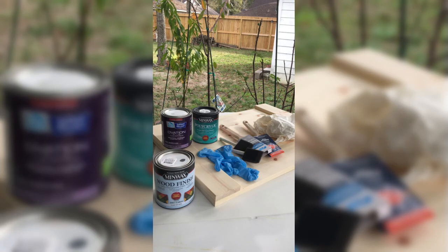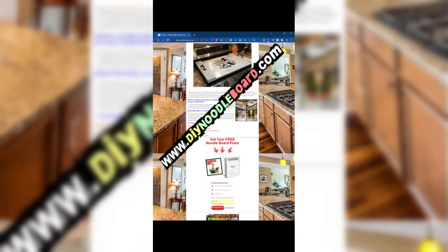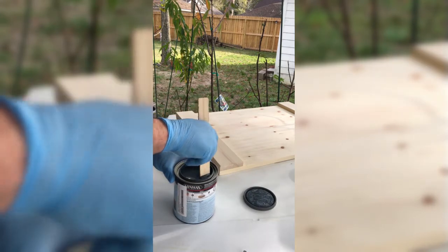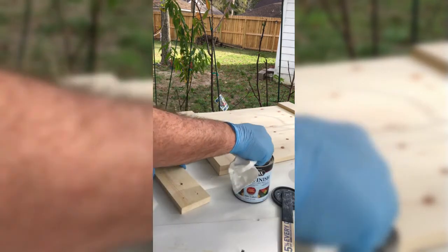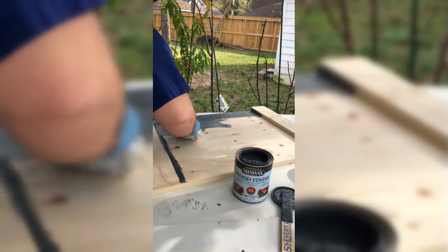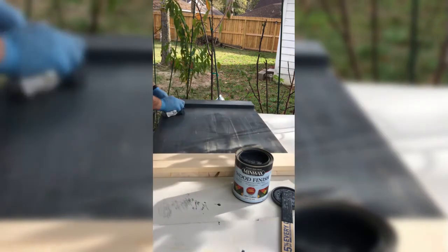I have a lot of information and useful tips on my website, which I'll link in the description and bio — free information and the plans for this whole project if you want them. If this is your first time applying stain, I'd recommend taking a small test piece. Apply the stain so you can get a feel for how it goes on, how it looks, and how it gets absorbed into the wood. I take the cautious approach because I only want to do a project once.